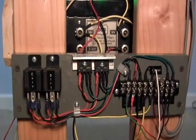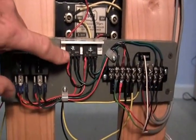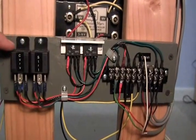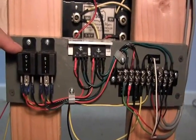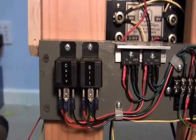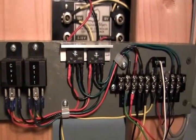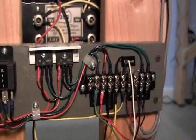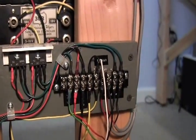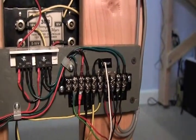Here's a picture of the relay control module, or essentially the brains of the system. As you can see, there's a couple of bridge rectifiers here which convert the AC power from the transformer to operate these automotive type relay switches. And if you look there, you'll see they're marked curved and straight, which just designates which position it turns to, whether it be in the curved position or the straight. The rest of it is just terminal strips to run the wire back to the appropriate switches, and then also other connections going back to the magnetic reed switches.